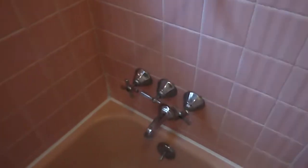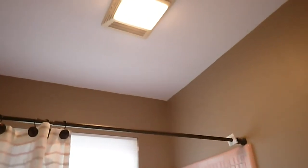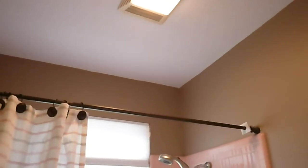If you've got a bathtub that has a shower, then you should have a single mix valve — you shouldn't have double valves like that — to prevent accidental scalding. We've got a storm window here; this interior window has definitely seen better days. If the window works, a vent fan is not required. You do have a vent fan though, but there is no vent fan hood on the roof.